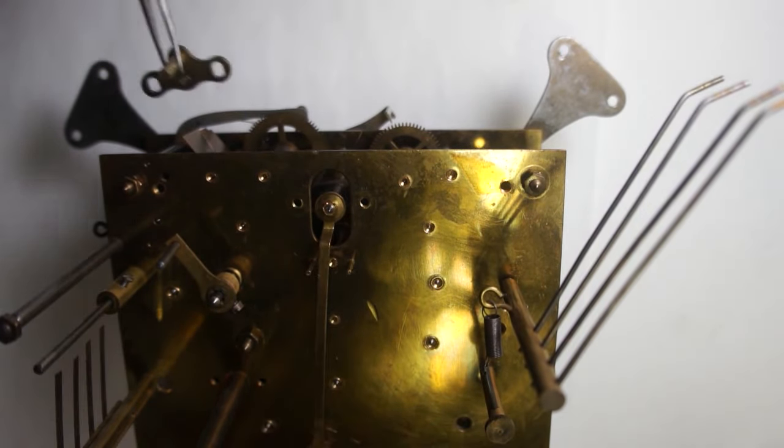So this dial pan is made out of steel, and it looks like it may have been plated with copper and then possibly brass plating on top of the copper. But because it does have a brass plating on it, I was really reluctant to sand through the original silver and get into the brass, because I don't know how thick that brass is. So what I've done is I've used some abrasive cleaner on it to clean up that brass that was oxidized.